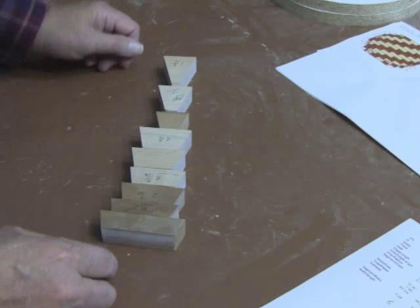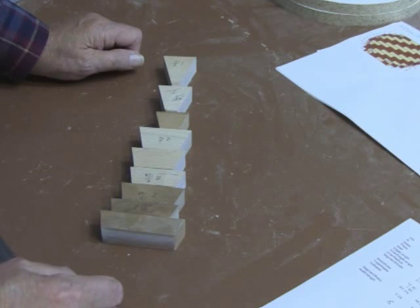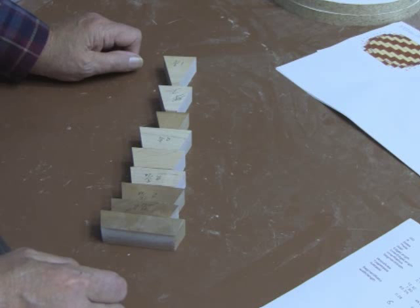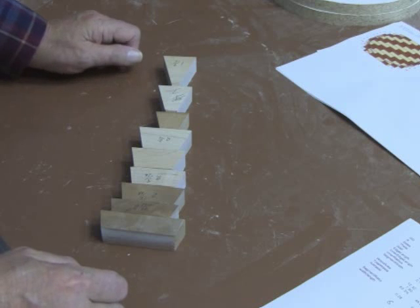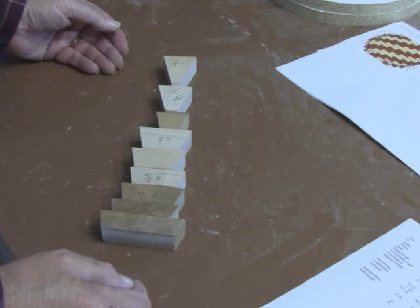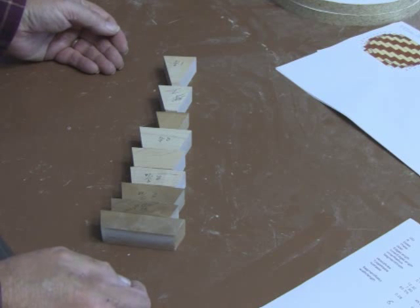As you go up in the number of sides, the waste situation gets better. Take that same 6-inch ring and go up to a 12-sided ring, then it's about 29% wastage. Going on up to 24 sides, it drops down to just under 10%. Doesn't really make a lot of difference though, because you're not using that much wood to start with. You're using so much wood less than you would be if you were working on a solid chunk of wood.